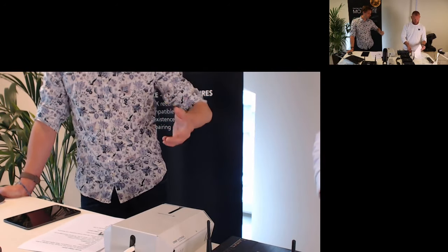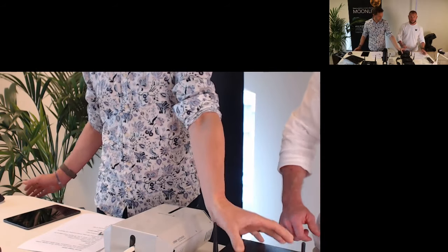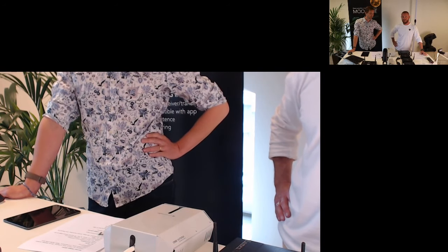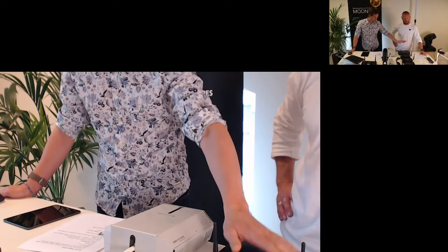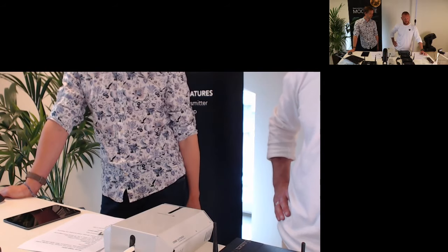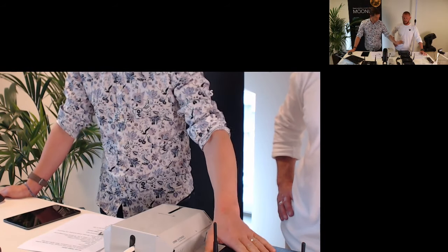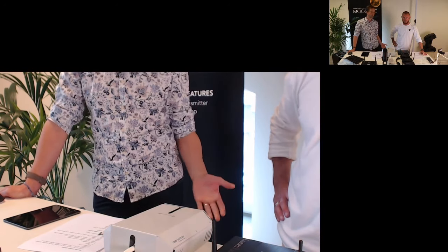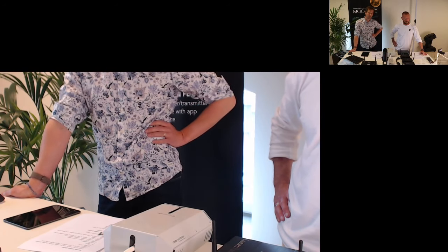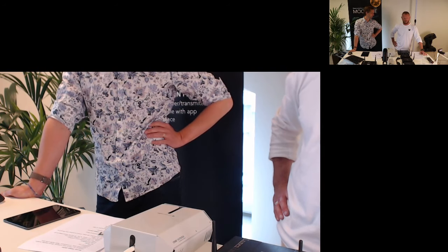It's possible to hook them up with regular DMX connectors, but also if you're using Ethernet, you can use most typical protocols based on Ethernet. These boxes will actually do the conversion from Streaming ACN, from ArtNet, from many different other networks, into DMX streams. So they will output DMX, but you can feed them with many different options, and you can set what kind of feed you input in the Supernova software. They're quite capable — they're not just DMX, they're quite a bit more.